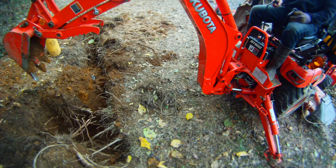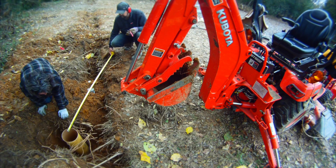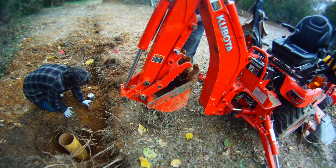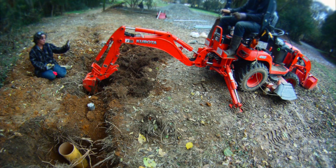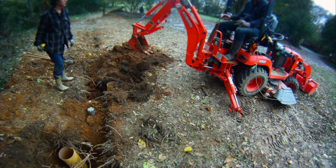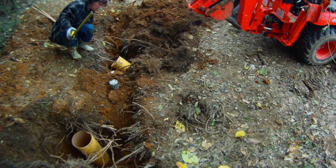Now we're just going to dig it out. We're going to dig two holes on each side to put these cardboard forms in. If I could do a perfect auger hole I wouldn't need the forms. My wife is measuring to make sure that we're placing the posts approximately where they need to be — measure a hundred times, pour or place the concrete once, sort of thing.